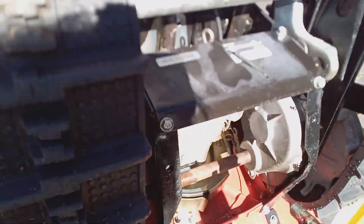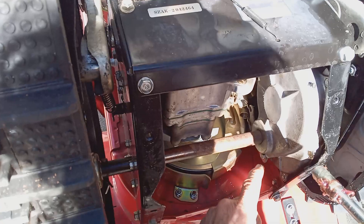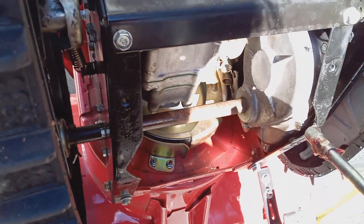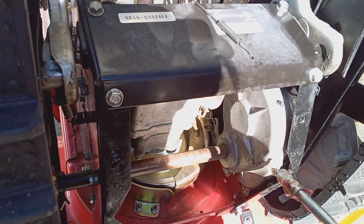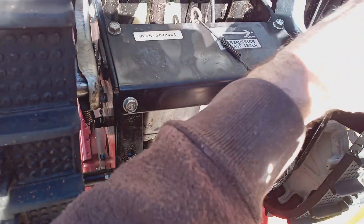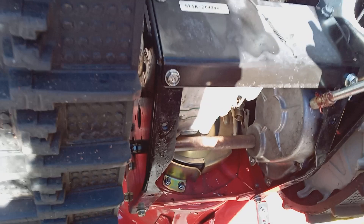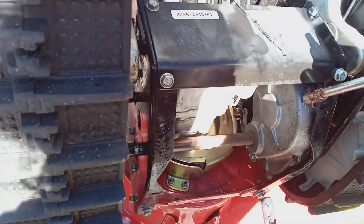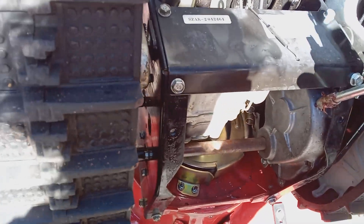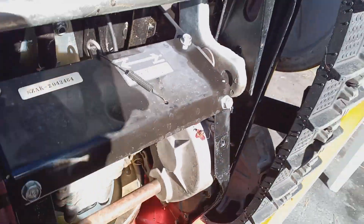Now it's time for the grease. You can't really put too much grease in here — when I rebuild the gearbox I fill it up with grease. If you put too much it may come out through the openings, but I haven't seen that yet. People always ask if you can put too much grease in, and I say no. The main thing is to pump in new grease every fall — about 20 to 30 pumps, though you can put in as much as you want.